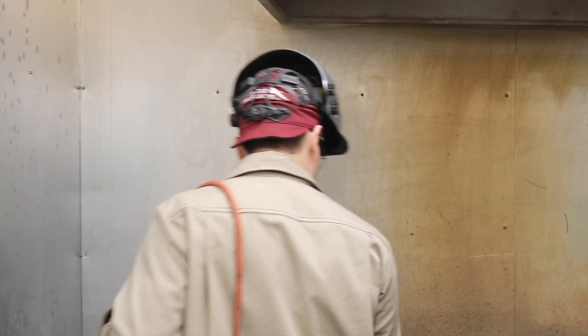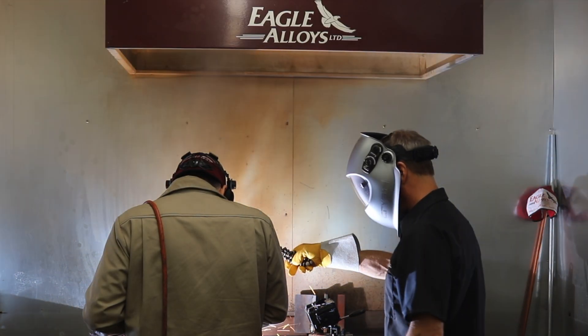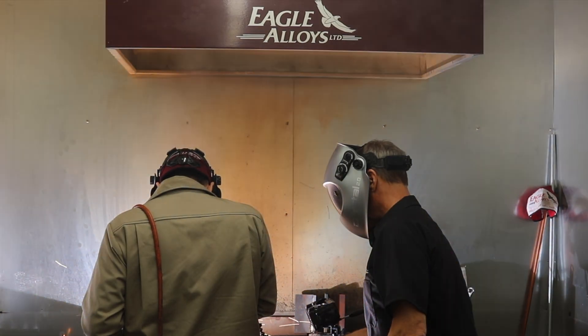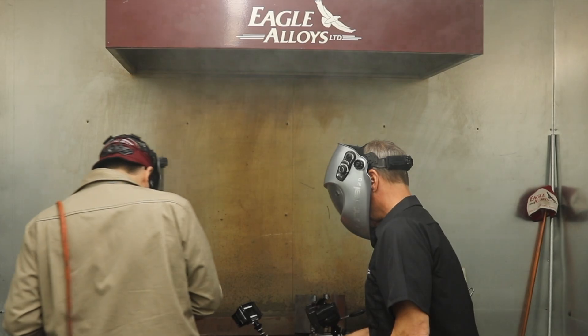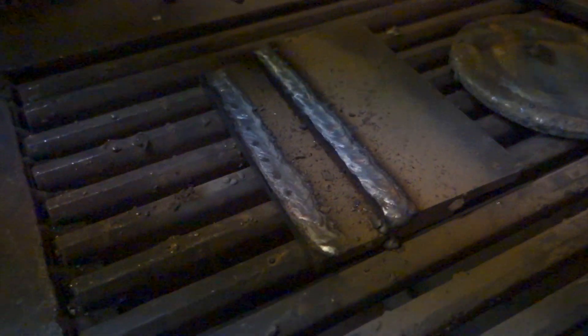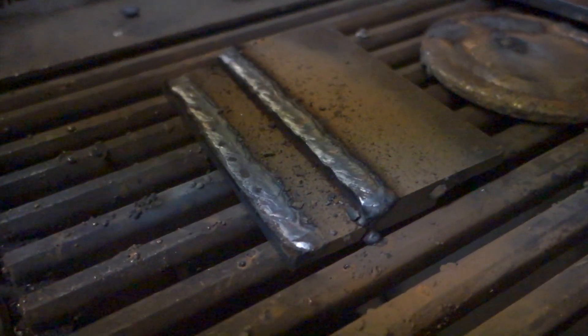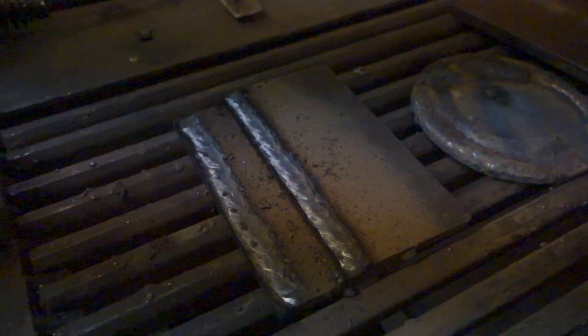I'll do one on this other side of the plate here. It looks like you're really close to the edge. That's right, it can run real close to the edge. As long as you point your rod angle into the plate, it can hang that edge real tight, and the slag peels off almost in one big chunk.